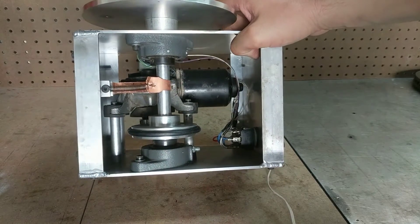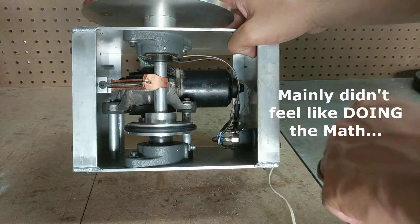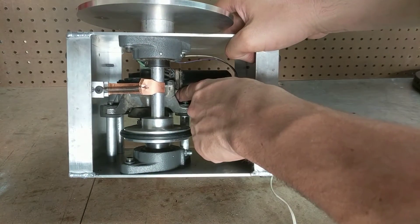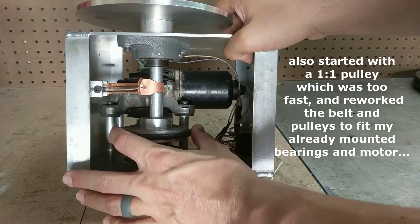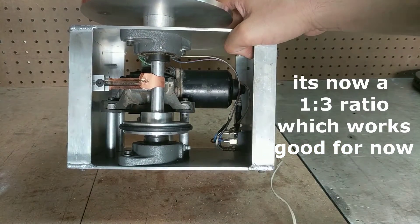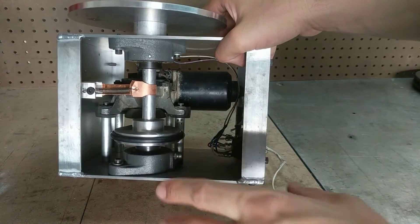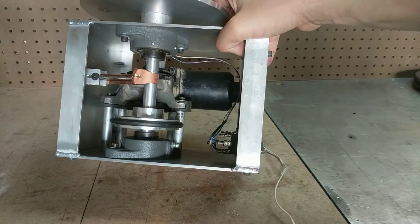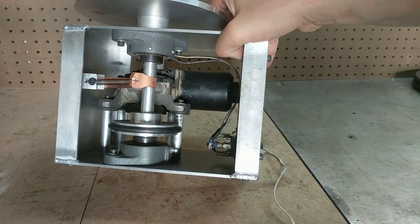The belt is actually an o-ring for something large — I'm not great at calculating belt sizing, so I started at a three-and-a-half-inch pulley since I knew I wanted a one-inch pulley coming off the motor. That was a little too big, so I came down to three inches, put a nice groove in it, and it fit perfectly. There was a little trial and error — turning it down a bit more each time — but I was happy at three inches.